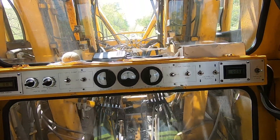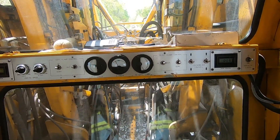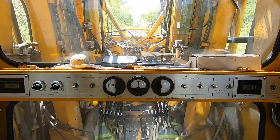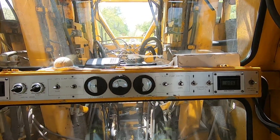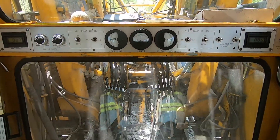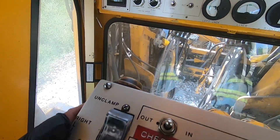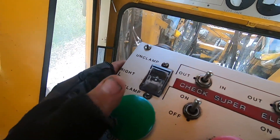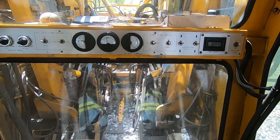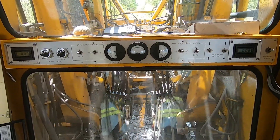Show time — lining track. This is railroad. That needle's going to be like on the graph here — it wants to throw the track that way, which is what we want. I'm moving the machine ahead with this index button right here. I've got the workheads in auto — they're going up and down by themselves. I usually like to do this manually, run the workheads up and down by myself.